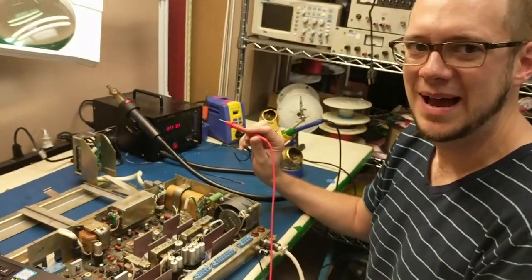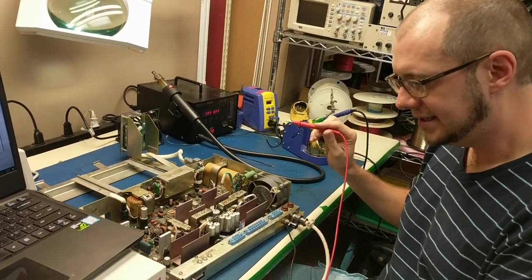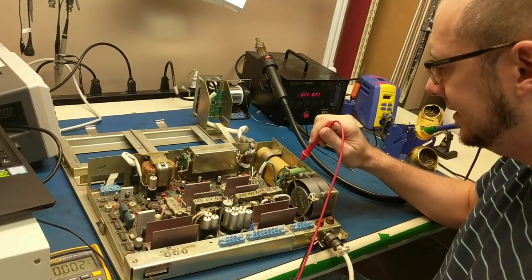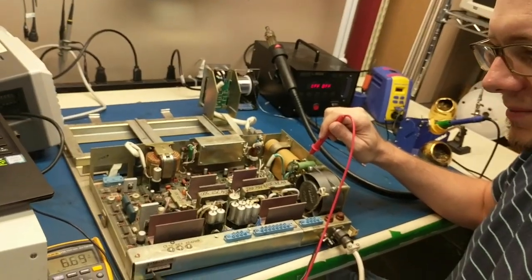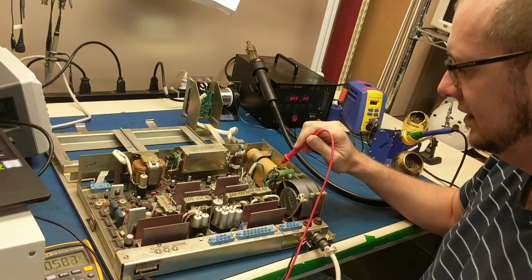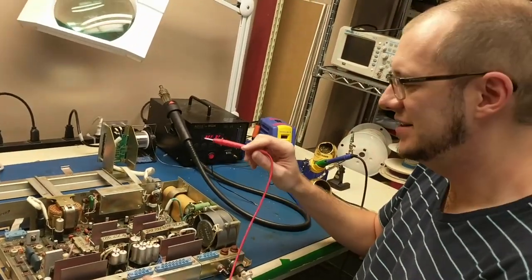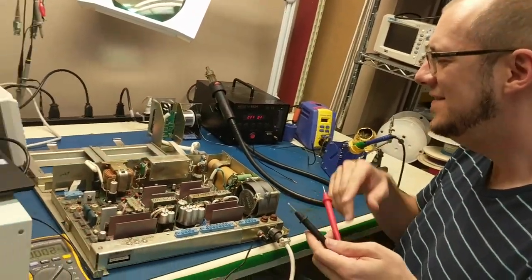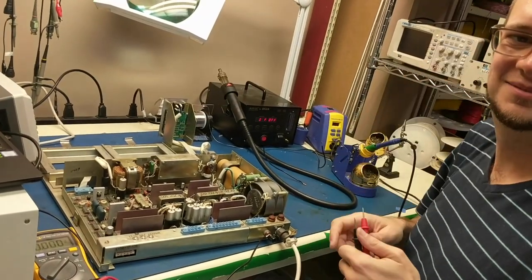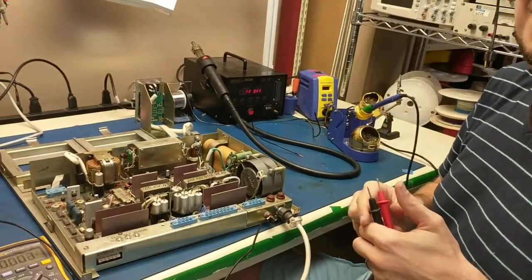Just for kicks, we're going to try that power resistor out here. We got it grounded, and we're going to try getting a view of these lines. It's rapidly diminishing — 7 volts down to 5, then 4. Basically, it looks like this resistor is in charge of bleeding off all the extra power that exists in this thing, so if you accidentally touch a capacitor later you won't totally shock yourself — or die. Yep, this thing's taking the heat for you.